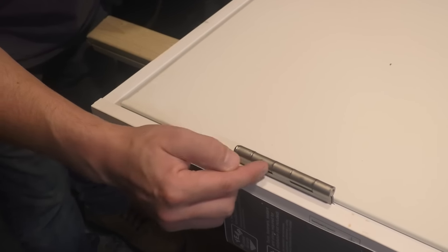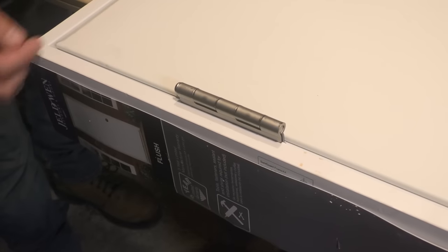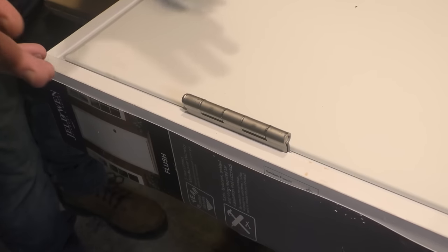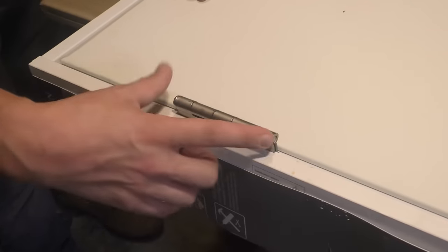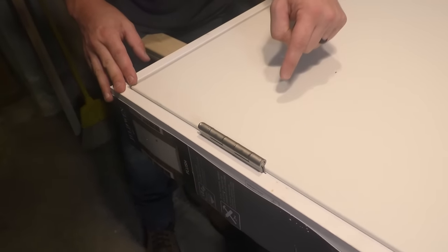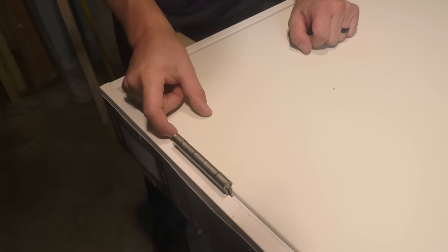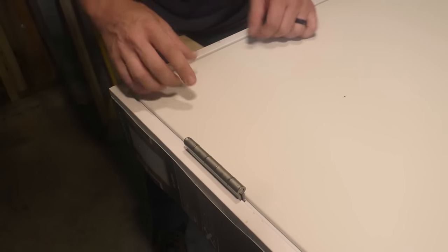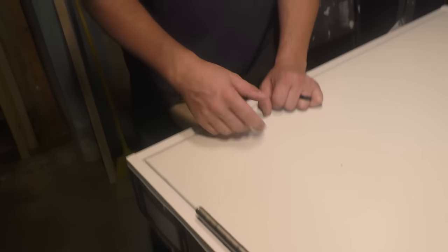I am going to end up being into these hinges because I think I have to take off about 10 inches or so. Then I will move this hinge down further and reattach it — I'll show you how to do that. And when I cut this door, usually these are filled with foam except for all the edges, so there's probably a piece of wood right here that I'm going to lose and want to reinstall. I'll show you what to do when we get to that point. But the first thing I'm going to do is take the door off of the hinges and remove the door so we don't have to worry about it right now.